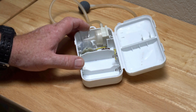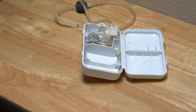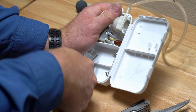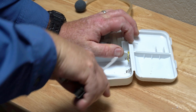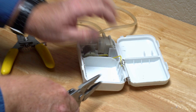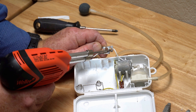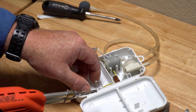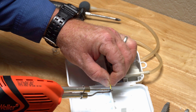Okay, so now we're going to modify our little box here, because we want to put our little project box right down in here in the battery compartment. We need to clean up the little dividers and stuff in there, so I'm just going to come in here and break this out and rip this thing out. Now let's take these battery things out and pull our battery posts out. You can cut these little wires off — I'm just going to desolder it. Desolder this. Alright, clean that up just a little bit — there we go.